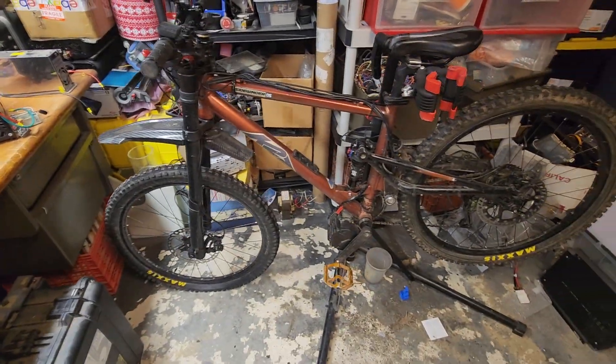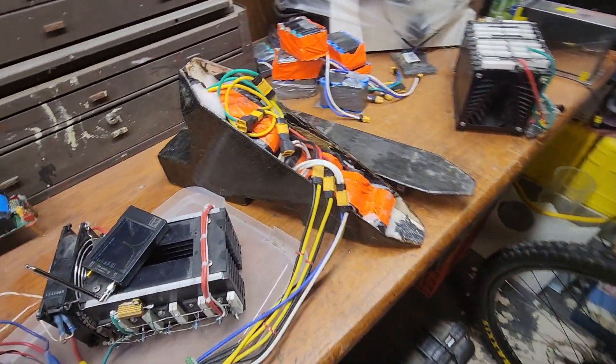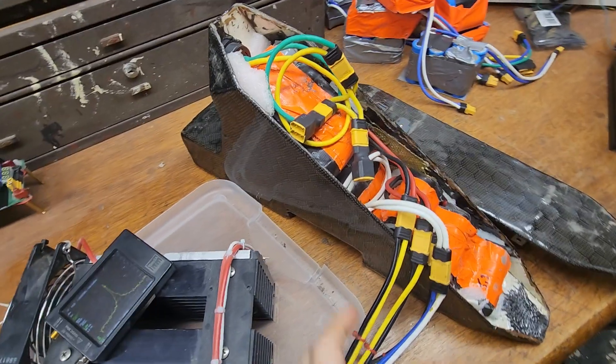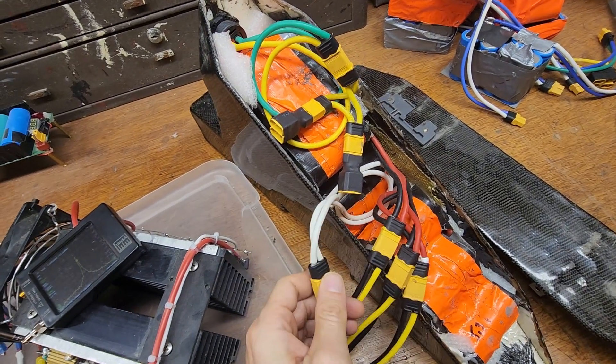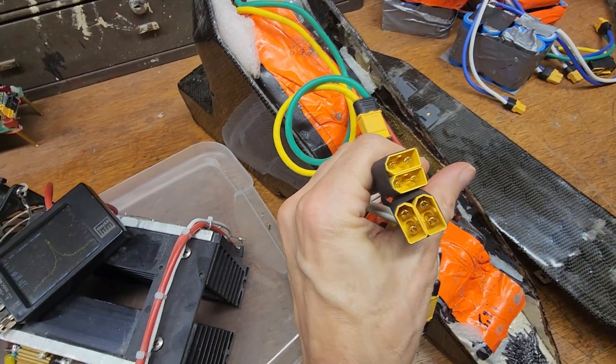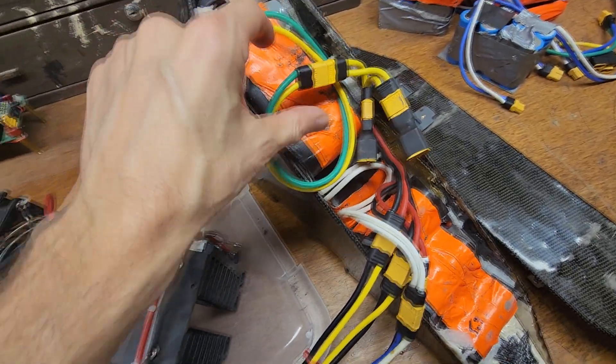That's charging my e-bike battery. There's my e-bike there without the battery on it. I built this during COVID, so I've been running this for a couple of years now. I got the batteries charging in parallel and then I connect them in series-parallel for running out of about a 52-volt battery.